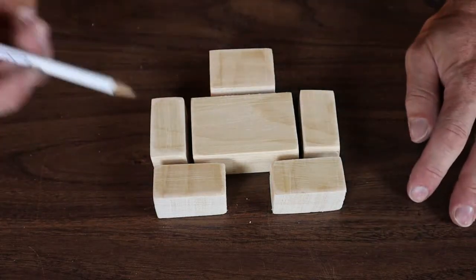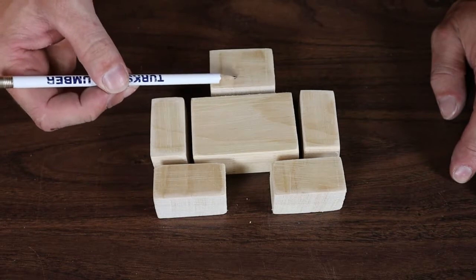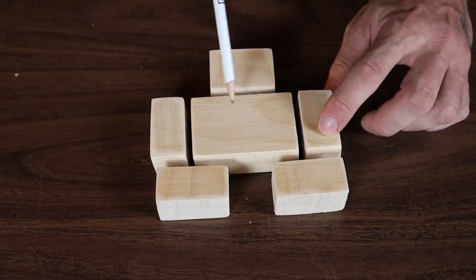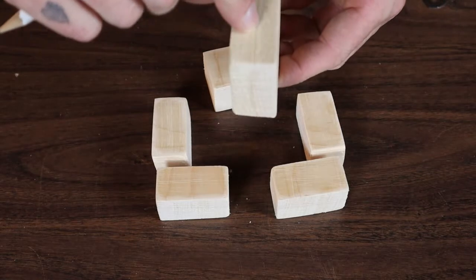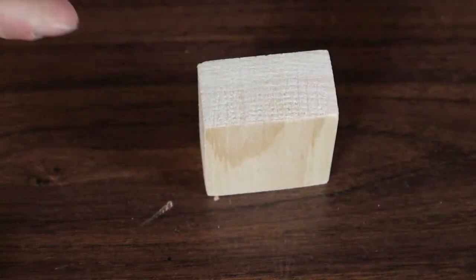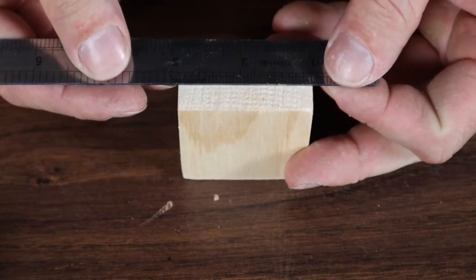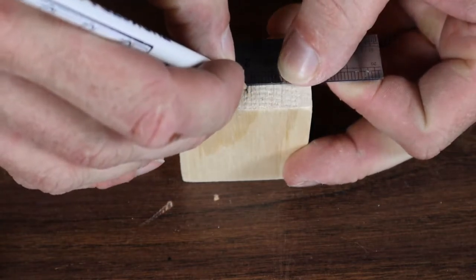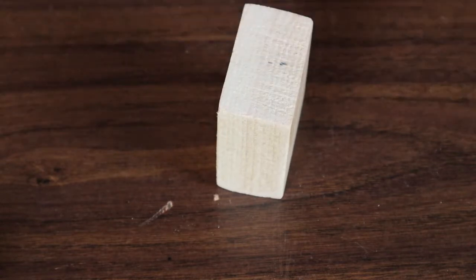This is how it's going to look. To attach the pieces with twine, rope, or string, we're going to drill a hole straight through the center to attach the head to the body. Then we're going to drill two holes down the sides to attach the feet, and a hole across this way to attach the arms. That arm hole will need to be slightly offset so it does not intersect with the hole going through the middle to hold the head. We'll find center, mark it — this piece is an inch and seven-eighths wide — move the ruler a sixteenth over, and mark center.